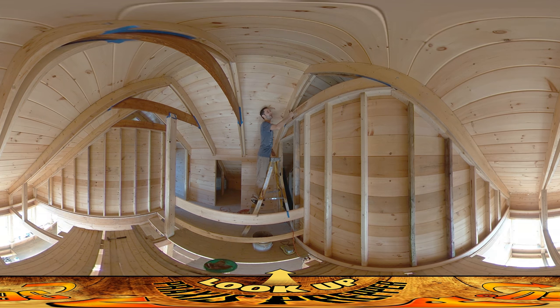All right, and as I put it on, I'm going with the grain of the wood here. I got most of the stain off, and what you see here is a result of just me touching the tips into the stain bucket there. So you can see a little bit goes a real long way. Now that the brush is a little dried off, I'm going to kind of feather it up into that corner there. This board here, I don't have to worry about getting stained, because it is going to get covered up later.